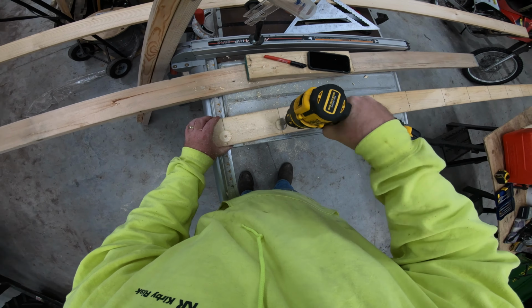So it's whatever way you want to attach this to the wall, whether you want to use metal brackets or some other 2x4s and you can put them down. Basically, you just need something to screw this into the wall with. You could always run a screw long ways through here, but it might be a little difficult and could potentially split the wood. So now what you need to do is the exact same thing with the top board.